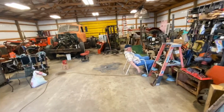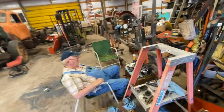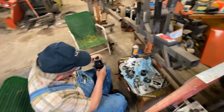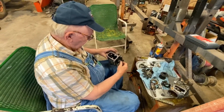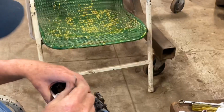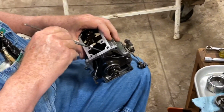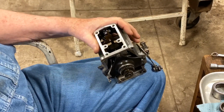And I thought of something I should have mentioned while we were filming at this pump that I checked, that I failed to mention. Inside here is a friction clutch, friction drive that drives this governor shaft. This spider right here that the weights are on, that are pinned on. Down behind the weights, there's a spider in there. I'd have to take it off for you to see it.